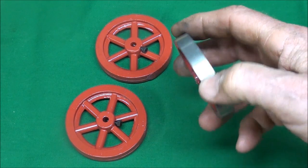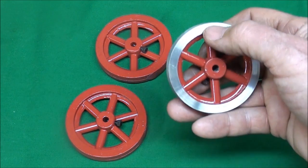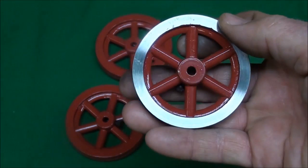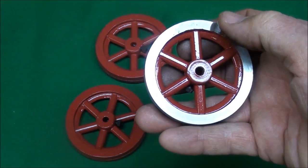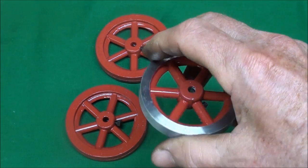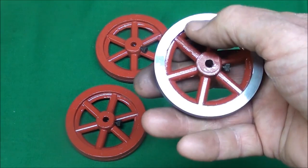As soft as lead is, it is sometimes difficult to get a good finish. The tool that I ground is extremely keen, with very sharp angles, and I still sometimes get a little bit of chatter. I think some of it is that the spokes are actually flexing a little bit, as light as the cut is. I've tried different speeds, feeds, and tools, and just try to get the best finish I can get. It is not really that critical. Notice how nice it is when you paint them first and then machine them — you don't have to worry about masking, and you get a real clean line.